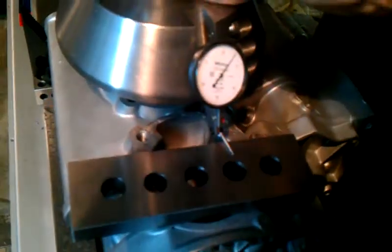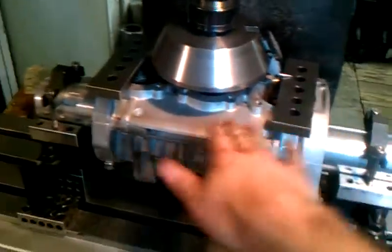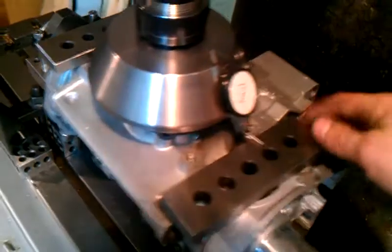Now, no matter what I do, if you come over here and look at this side of the case, you can see the dial indicator moving — I have three thousandths out of flat on this side. That indicates twist in the case, or unevenness in the top deck. I know this because my whole jig is set up dead flat, and that is exactly why we're doing this.